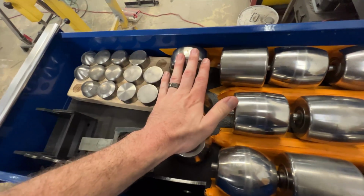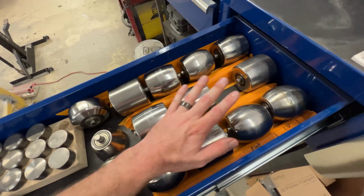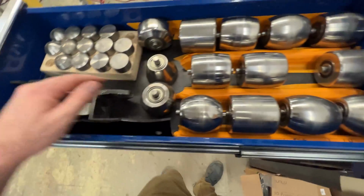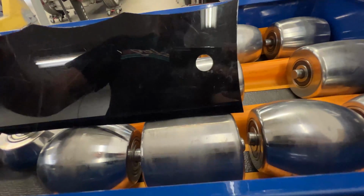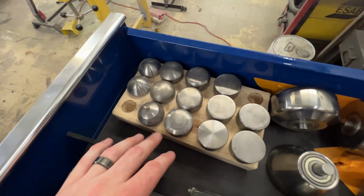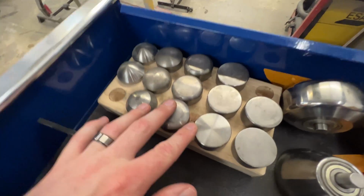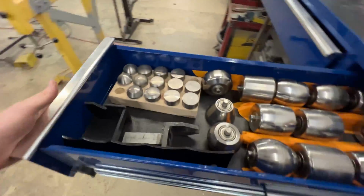Again, that wheel was the best wheel I've ever used in my life and probably ever will be. And we have a plethora of different style anvils here of different radiuses, along with a radius gauge that you can use to check your panels and match them to the wheel you're using. And these are the planishing anvils, or I think you call them anvils. I don't call them anvils. These planishing anvils have different radiuses, just like the wheels do, for shaping panels. That's where I keep them here.